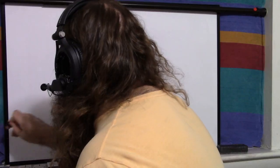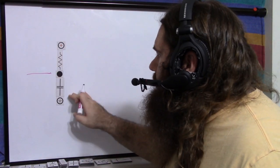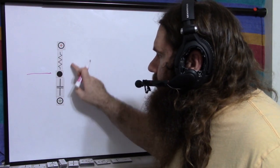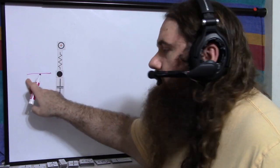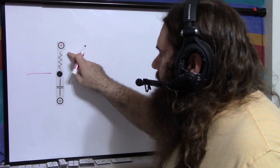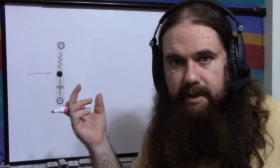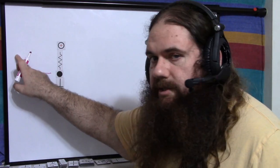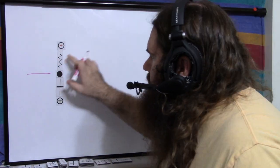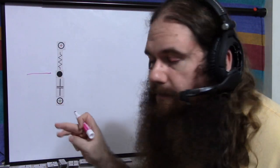So here's the timer — this will go wherever. If the capacitor is fully discharged when it gets power, the voltage starts at zero because the resistor has all the voltage drop, so we start low. Then based on the RC time, the voltage rises and eventually counts as a high. You can put it through a Schmitt trigger — toss a 555 timer or Schmitt trigger chip in there so that once it reaches a certain voltage level the output snaps high. You could also use a BJT inverter. So there's the boot-up circuit.